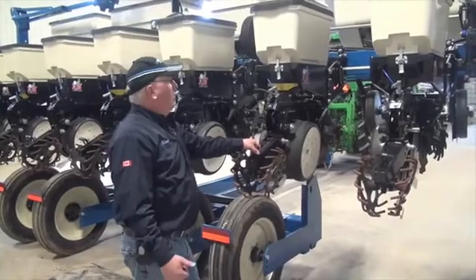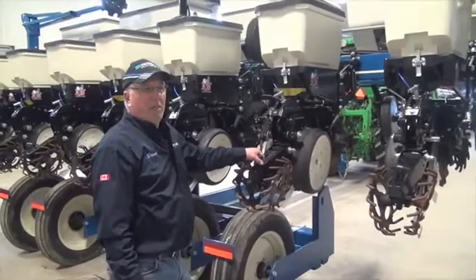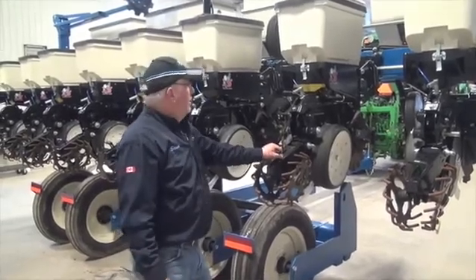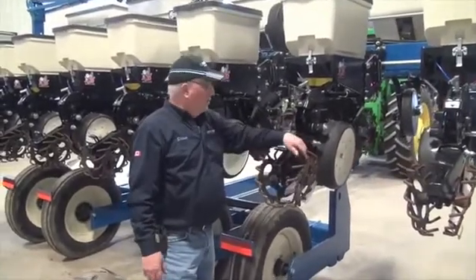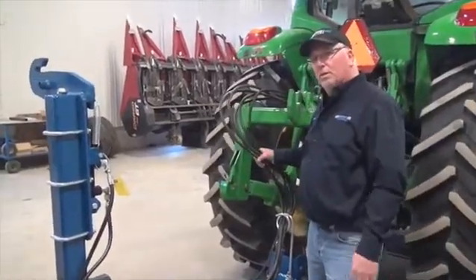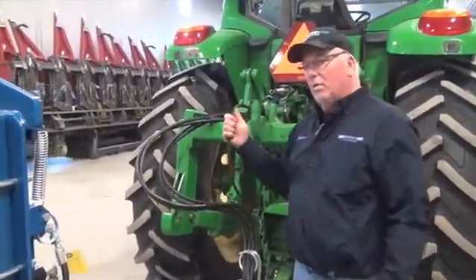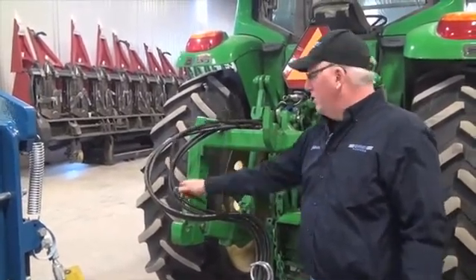Make sure that everything is wire tied down properly, and make sure you only use black wire ties as white wire ties are not UV resistant and will break fairly soon after you install them. So make sure you route everything properly and go over the whole planter — check all the bolts and make sure everything is in working order. When we're doing service calls in the spring, one of the things we see overlooked a lot is the hoses and wiring by the hitches. All the time we get service calls where we're actually cutting or rubbing the coating off the wires, causing shorts and everything else.